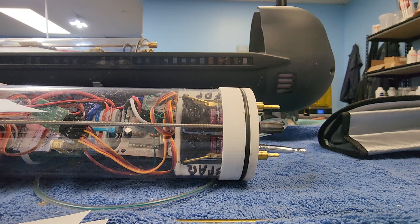I've got them fully up here — now I'm going to try and retract my bow planes. Notice what that bow plane servo does: it did that automatically. I'm still in a full rise on those forward dive planes and it's locked out. The cool thing about this is it handles not only a nice stately extension and retraction, but it ensures that your linkages don't bind up when you have those bow planes in the fully extended or retracted position.